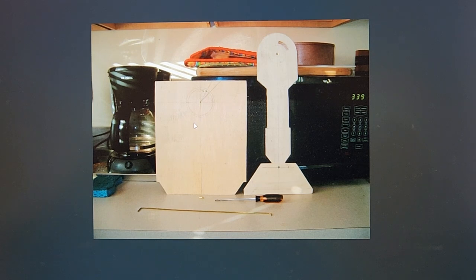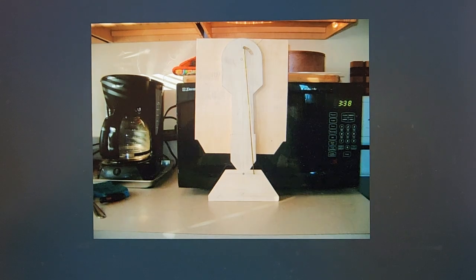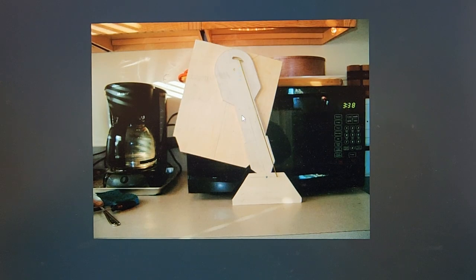When it comes to building anything, try to make it tunable — from mounting points to limit switches. When I put limit switches in, I don't just drill holes and mount them; I mount them on slotted holes so they can be fine tuned. So when the body forces the leg back and you get this body-to-leg angle, the leg-to-foot angle is done as well. And if it's not quite right, it can be fine tuned — not only in distance from the pivot point, but in the length of the leg rod.